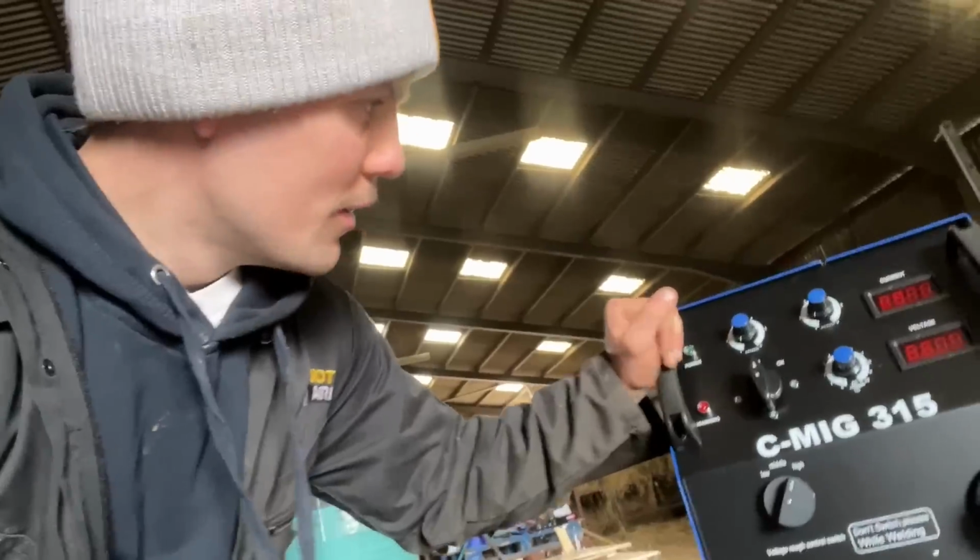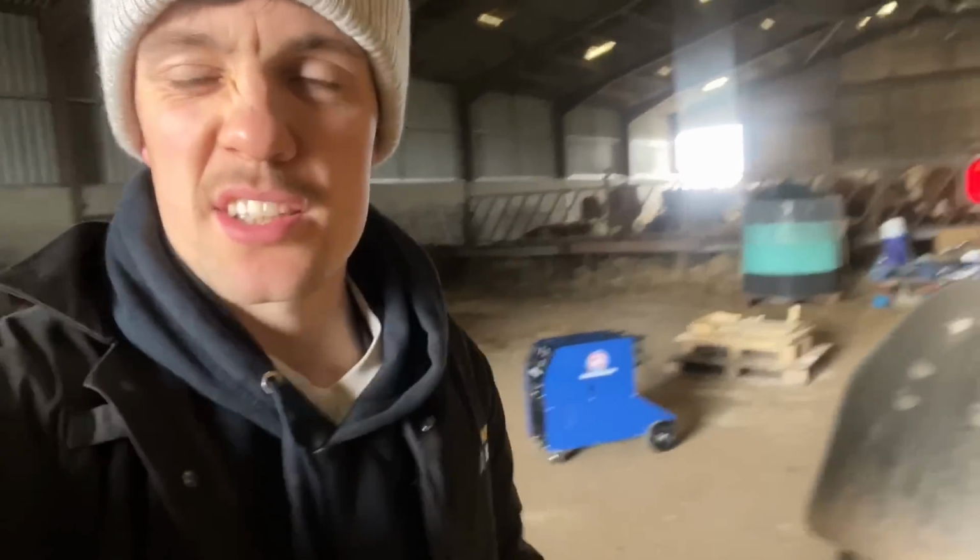Anyway, this time round, I know a bit more about welding. I do quite a bit in the workshop, so I was needing something a bit beefier, with a bit more capacity, a better duty cycle, and able to weld thicker material than my old one. Some yoke. It's got some weight about it. It is a transformer welder. Transformer welders are better for farm environments where it's inconsistently used. The conditions in the workshop can be pretty rubbish, damp, cold, so better a transformer that way.